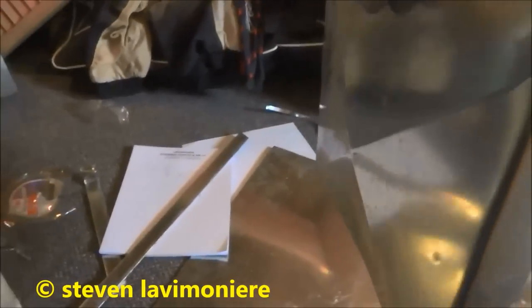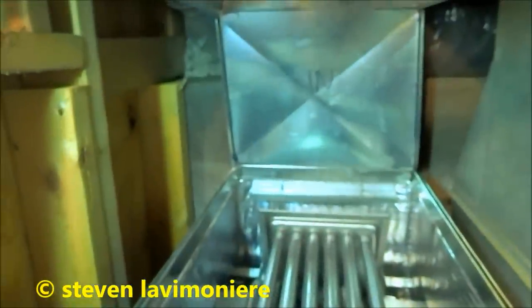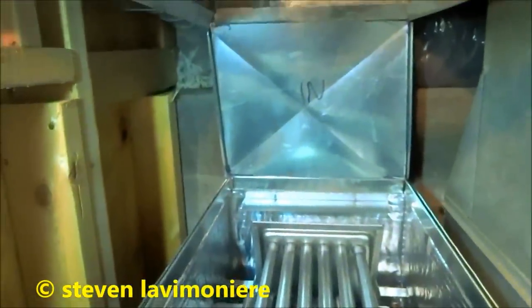You've got to cross-break it from the inside if you want your bends to go out. If you cross-break it from the outside, your bends will go in — it looks bad. That should be my piece — that should fit in there perfect. Steve's a real working man, next level.